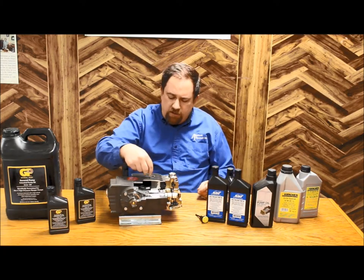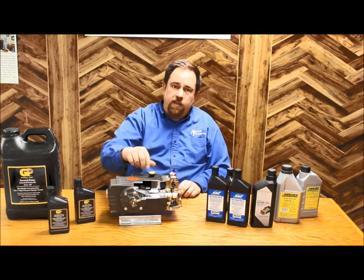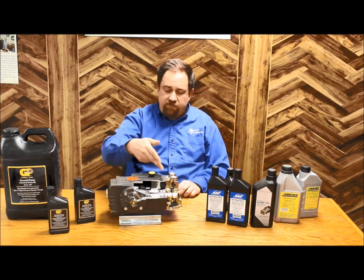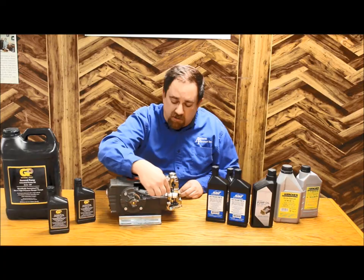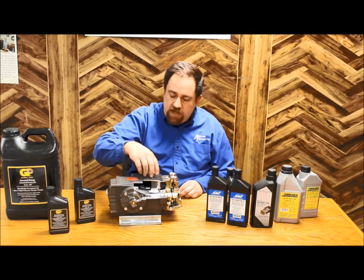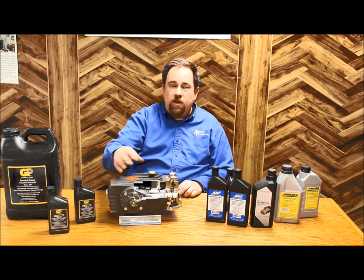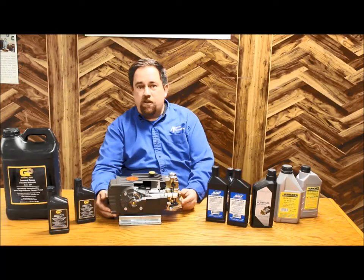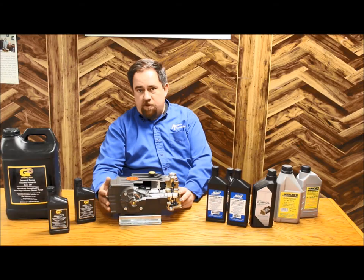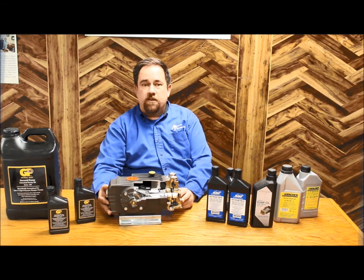Take a look at your oil — if it starts to look milky colored, there's water in that oil. Change it right away and try to identify where that water is coming from. Water could be getting into your oil by dripping on the pump manifold, or there could be a crack in a ceramic, or you could be getting it in from humidity in the air — kind of like dew on a windshield. That moisture coming into the oil bath will turn your pump oil a milky color. Keep on top of that and keep your pump well maintained. We're glad to do that work for you. Give us a call today.